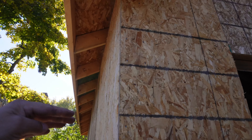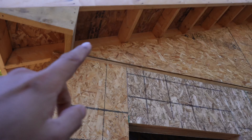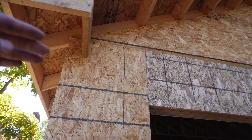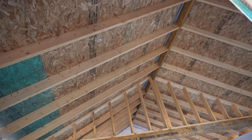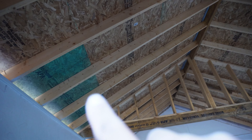This piece here will help when the soffit comes level across the back — it ends there — so the soffit has a spot, ends there, and this will all be wrapped in aluminum with square soffit all the way down the side. It will vent through that side, and then the foam gaskets up there will help vent the roof out.